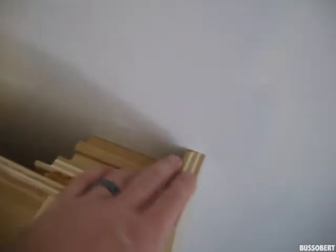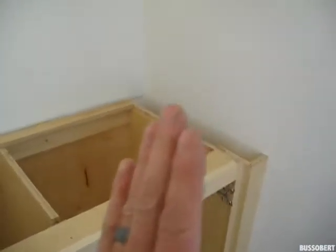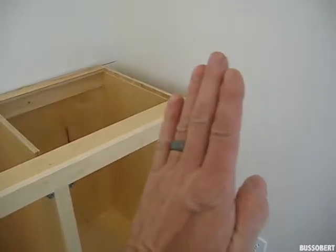We're in the process of attaching this to the wall. We've glued these fillers and filled this so this whole cabinet — we screwed it so it literally squeezes to the wall. Fill both of these up so the panel will fit flush to this and we can suck it in. That's what we have on the top and the bottom.